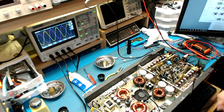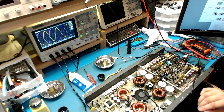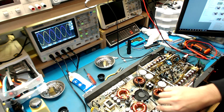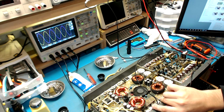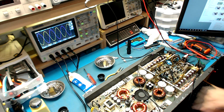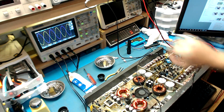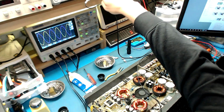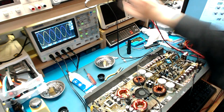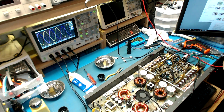Okay, so I went through and checked the manual a bit, and I had the ground connected to the wrong spot for the loop feedback. It's got to go back to the power supply ground to verify that your RCAs aren't floating, and we're good. It's all green lights, and the music light is flashing, indicating that we have a signal. Shut it off. Solid. All right, so that's working. I'll verify the 10-volt low. No, everything looks good. So the only thing we have to check now is the biasing, and that's pretty simple.